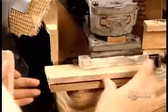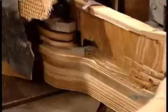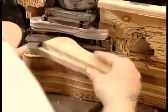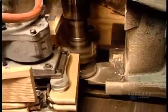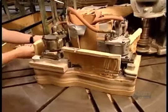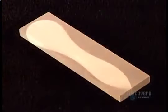The next step is called molding — a series of saws trims the blocks to the required thickness. Now they contour the pieces using a machine called a shaper. The machine revolves, running the block's outside edge against a cutting head. This profiles half the block; workers then turn it around and line it up for a second pass to profile the other half. There's a different shaper machine for each model. This type is known as a dauber, a brush for waxing shoes.